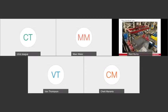So to minimize our footprint on the mill floor, our solution involved using four legs of 450-ton J&Rs, coupled with our custom high-strength box girders that you'll see in this picture, and our 750-ton hydraulic turntable. And this turntable allowed us to control the rotation of the bridge girders after we extended the gantries to lift the load. And the turntable also gave us a wide enough base to support the crane so that we retained stability throughout the whole operation.